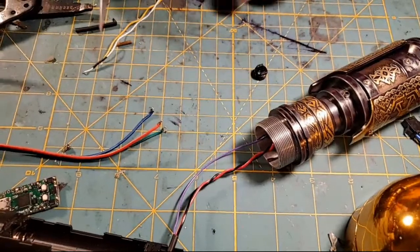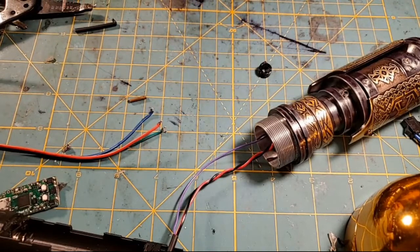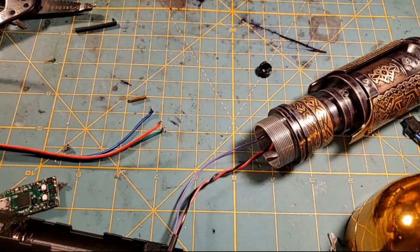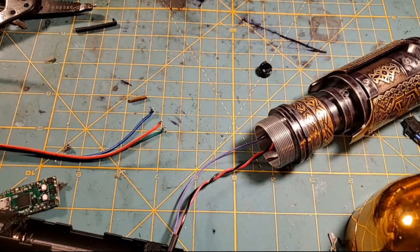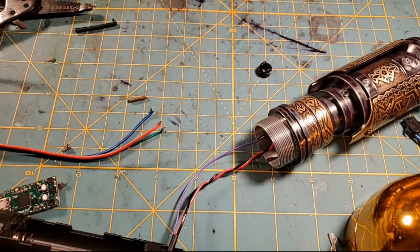This sucks because all your stuff is in the way here. I really need to take this switch apart. I really think the appropriate solution here is just taking this switch apart. See, I'm on the right pad there, and the solder won't even take because these things are so small. I almost need to be working on these things under a magnifying glass.